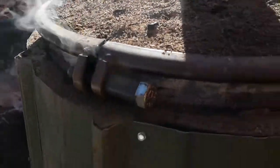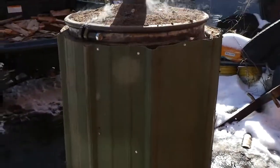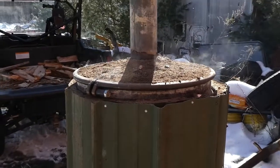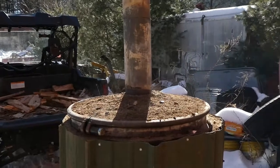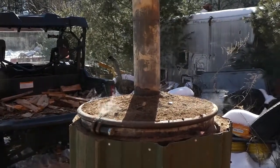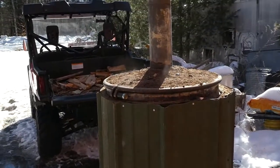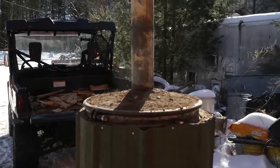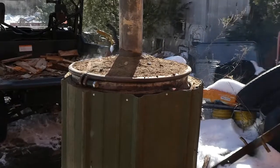She's starting to push steam out of the ring there, so this thing's getting ready to light off. My estimate is that by three o'clock — giving it four hours of cooking — it'll be in full beast mode. That's where pyrolysis takes over and really just pulls the wood gas right out of there and burns it off, and you're left with nice pieces of carbon. Okay folks, have a good one — back to work, bye bye.